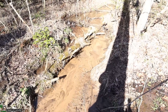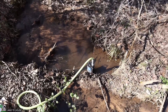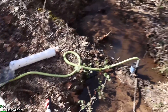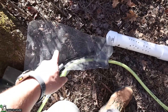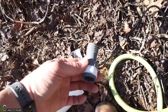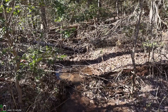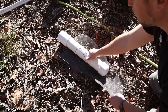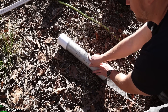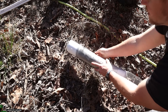As you can see, there's plenty of water flowing in this creek, and we are going to be placing the intake screen up here in this pool of water — it's somewhere around eight or ten inches deep. The intake for this half-inch ram pump is going to be a three-inch pipe with a bunch of holes drilled into it. I'm going to be putting some window screen around that, and on the back end of this pipe I have an adapter that goes from one-inch threads to poly pipe. This piece of window screen will keep out some of the larger debris; it won't keep out all the silt, and that's what the silt filter bucket is for. I'm just going to place this screen over the pipe and use some zip ties to keep it in place.